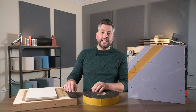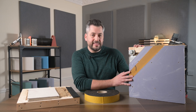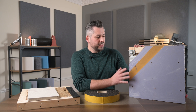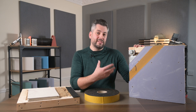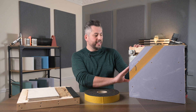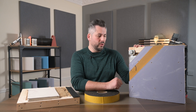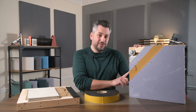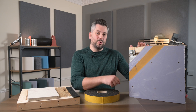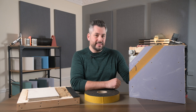The other application is for stud walls. Take the example of our Reducto Clip independent system — a system used to soundproof a wall where, to get the best results, we decouple the system from the wall by installing it on a stud frame. This stud frame is typically installed around 10 millimetres away from the solid wall, but it's still touching the ceiling, the floor, and the returning walls either side, so some vibration can still flank back into the system.